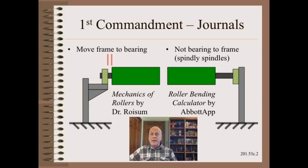One of the ten commandments of web machine design is to avoid excessive roller deflection. This was covered in great detail in our Web 101 class and elsewhere. Bearing position has a huge effect on deflection. While one normally can't put the bearing inboard about 25% of shell width — the optimum position for minimum deflection — you can do the next best thing: to put the bearing housing so close to the head of the roller that it is almost touching.